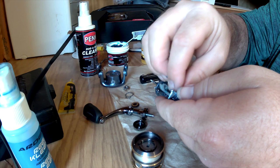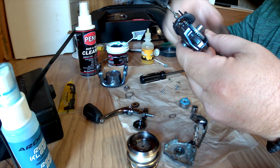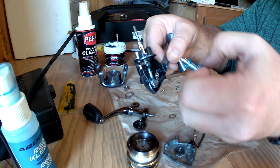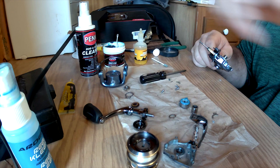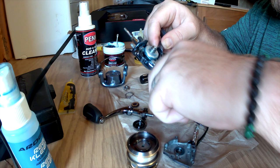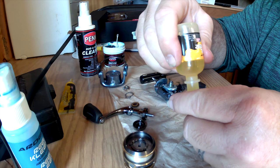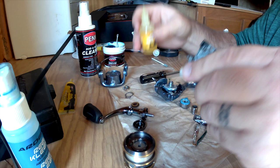Basically what we got here — I'll break this down for you real quick again. I put everything back together. I oiled every gear with this new grease. As you can see, it's all greased up in there — not too much, but enough to make sure everything stays well greased. The bearing on the other side: you use bearing oil on that, not the grease. Use the real oil. I've greased up everything else. These parts I put just a little oil on, and on the shaft I put the grease. On the bearings, coat it on both sides — that keeps your bearings working.